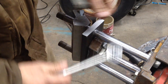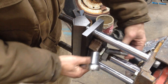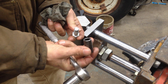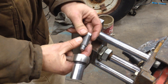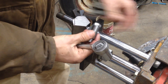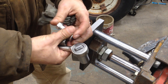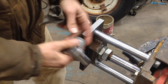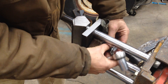I just got done checking to make sure these bolts fit in there and hold it on correctly, and they do. I just made a little bushing — I parted the DOM tube using the lathe and made a quick bushing. That'll hold it on there great. I'll probably put a washer on there first, then put it in. That ought to work just fine.